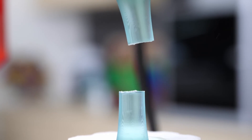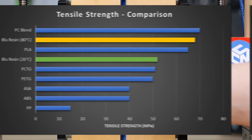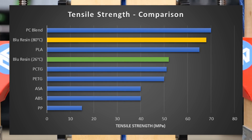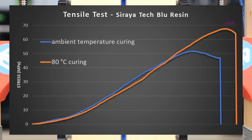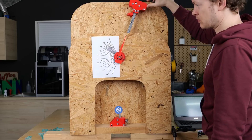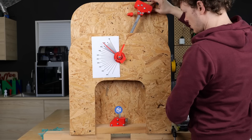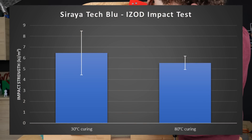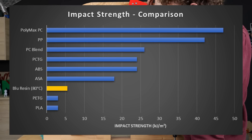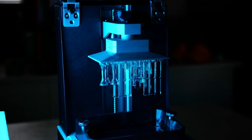The final samples post-cured at 80°C really led to the absolutely strongest parts, failing at 68 MPa on average with minimum scatter — that's 41% stronger than the reference, well in the range of what I usually measure for PLA or even polycarbonate FDM 3D prints. The samples lost a bit of their ductility, meaning they didn't yield as much before failure compared to samples cured at ambient temperatures, yet they didn't feel brittle in any way. I also checked this with impact samples struck by a swinging hammer — I saw a slight reduction in impact strength, yet nothing serious, and the impact strength itself is still over that of regular PLA and even PETG. This again shows that if you use the right SLA resin, these parts are not only strong but also tough.